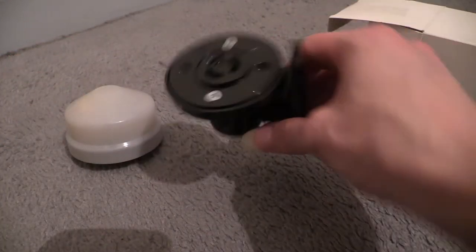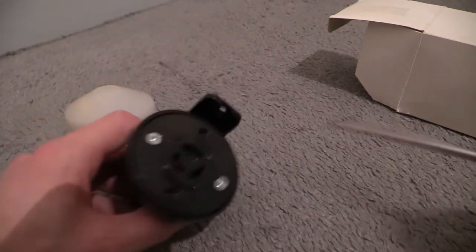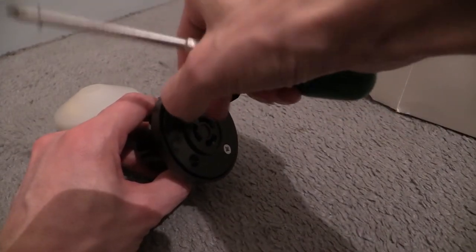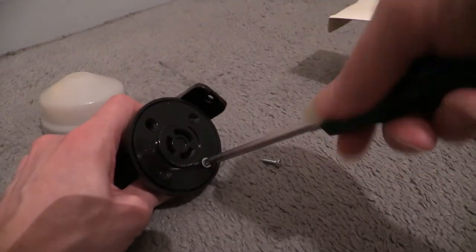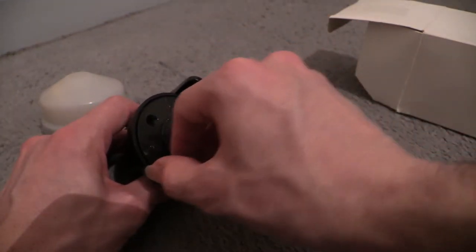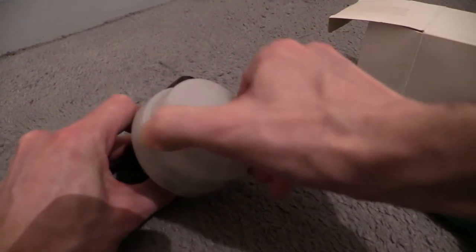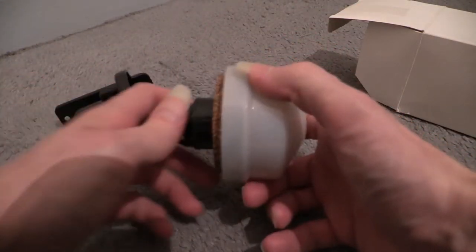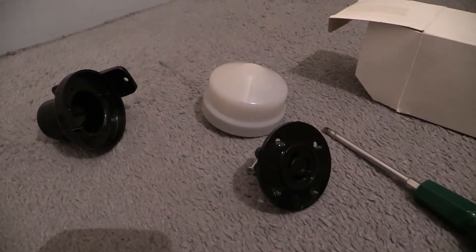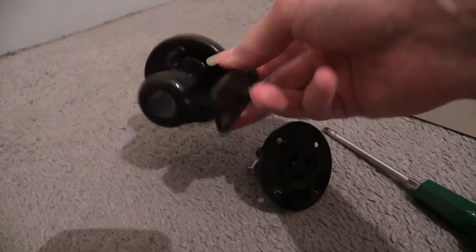There are the wall mount brackets with sockets on top. I've got a screwdriver handy - we'll undo these two screws to get the socket out of the wall mount brackets. You need to do that anyway in order to wire it up. Release the screws and the base comes out. If it doesn't come out easily, you can plug the cell back on, lock it into position, and then just pull it - and there you go. There's a cork seal on it as well.